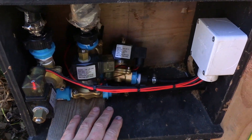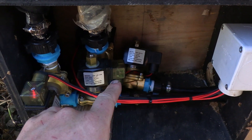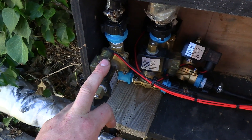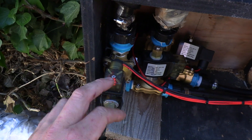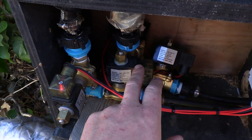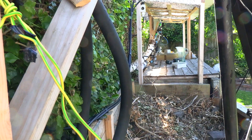These are the changeover valves for Solar Collector 1 and Solar Collector 2. There's a normally open and a normally closed valve on each of the two. Here are our booster valves — one and two. One's a return, one's an out, and then the same for the other collector: there's a return, in and out, open and closed. You can see currently this one is energised, holding the water back in that collector. And obviously the normally closed will be closed, so that's telling me the booster currently has water flowing through it.